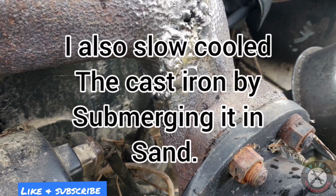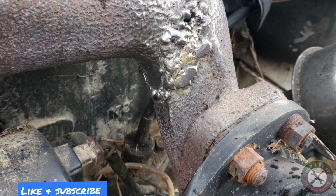And the process for welding cast iron is, I wouldn't say intricate. It's not a good weld. That's just point blank period. It's not a good weld. What I'm gonna do, I'm gonna link you to a guy that has a couple of videos on different methods of welding cast iron. And that's why I got the idea of beveling the connections together so I could get that welding material in there, and so it have a better hold. And I believe, so far it's been holding up, so I can't complain about it.